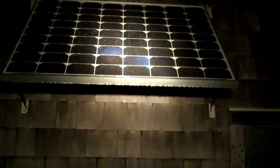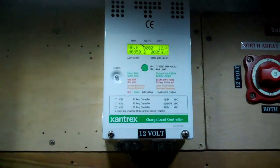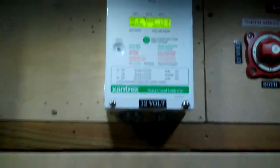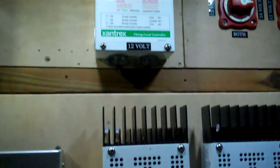By my calculations, a single 100-watt panel pointed in the right direction will take care of all that lighting — it comes on every night and goes off every morning. Remember, there are a lot more uses for a 12-volt system than a 24-volt system, because you can make chargers for iPods, radios, and all kinds of stuff, plus the LED lighting is so available. Go check out eBay or your local auto parts store for LEDs. You can do a lot with a small system.